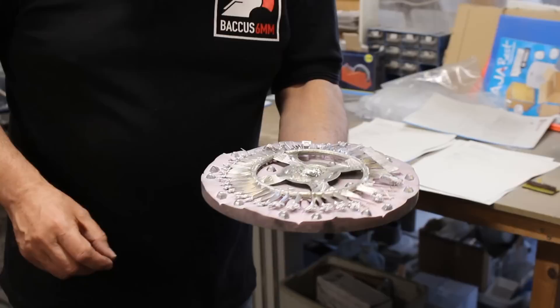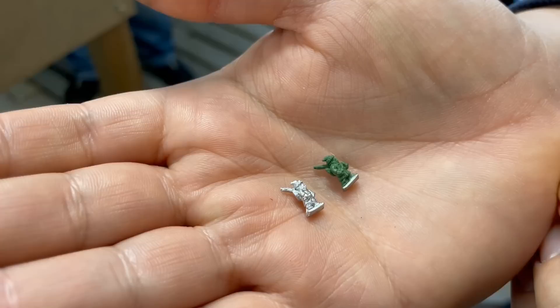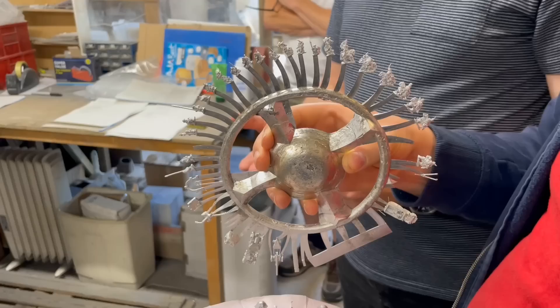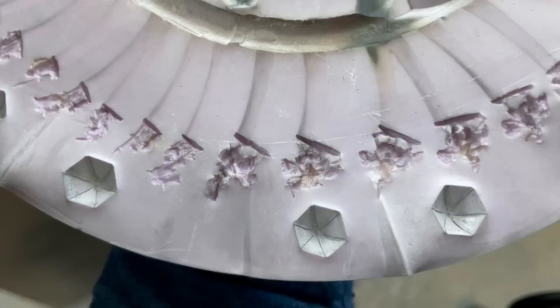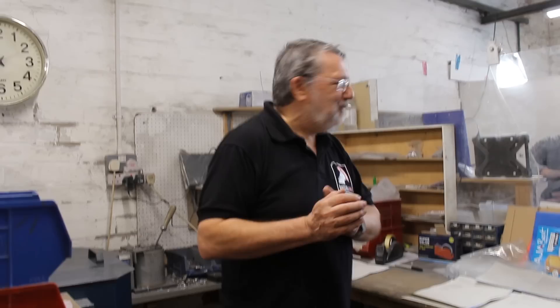You'll learn all about moulding soon. In all of these individual figures you will see this little chap, and you'll see that one is a copy of the other. These are little lines to allow the air to come out — they're vents. If you've got air trapped in a mould, the air won't want to come out, so you put metal in and it will stop and you'll get an incomplete figure. So the venting is really, really important. You just cut those with a craft knife — a scalpel — and when it gets really tricky, Andrew sits there with the Dremel and does unspeakable things to these moulds.